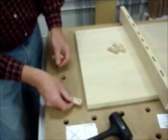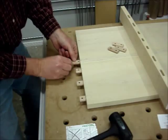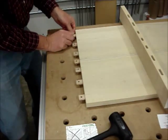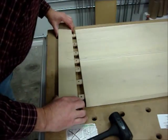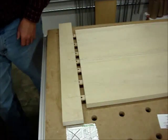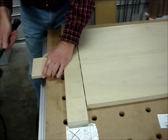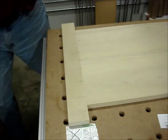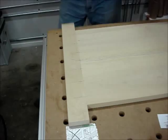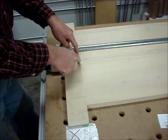I've got some dry fit dominoes here. These have been sanded down and you'll notice I've drilled holes in them — that's so I can pull them out, not have to hammer these in, and be able to disassemble the joint. So this is my dry fit. I'm tight on the outside and just that slight gap on the inside, so I pull this together with a clamp and that joint will close up.